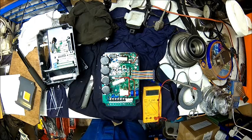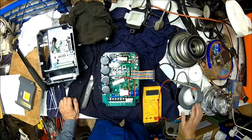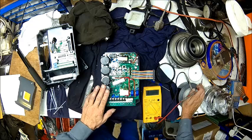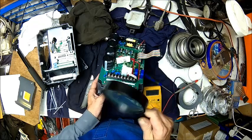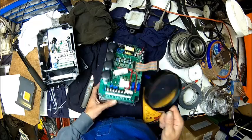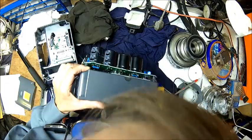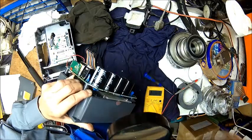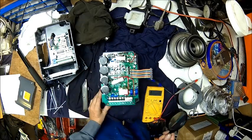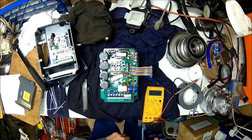You need to fit the components to make it brake. I saw that big relay and I thought it might be with braking, but it's not — that's a bit of a shame. Apparently it's got more capacitors than the fake one. Apart from that, it looks very similar to the 230 volt version. Maybe capacitor ratings are different — let's check. They're 400 volts, so they're probably in series, which makes it 800 volts. The discharge resistors — that's all good. So we should not exceed 800 volt DC with 440 volts. That might be close.